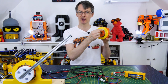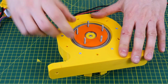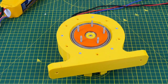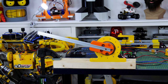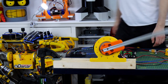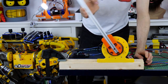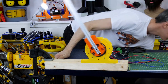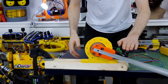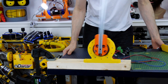I was much happier with the cycloidal drive version 2 when I made it, so that's the one we're going to test next. The cycloidal drive was much smoother moving and also back drivable, which means we can use it in dynamic robots. Again I've put the encoder on the back so we can use the ODrive to drive the motor properly. I've already attached a lever because I know it was already more powerful with the skateboard ESC — and yep, there's no chance of me stopping that with one finger. It just seems much more powerful altogether — a lot more torque, and it's still 10-to-1 and all 3D printed in standard PLA.